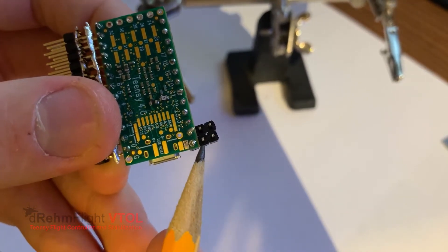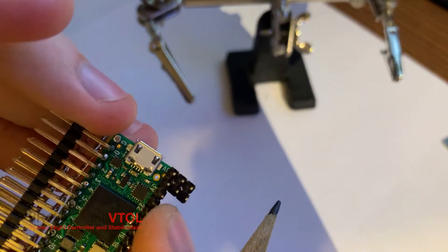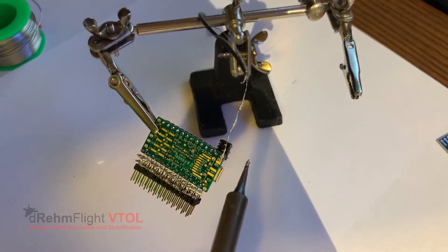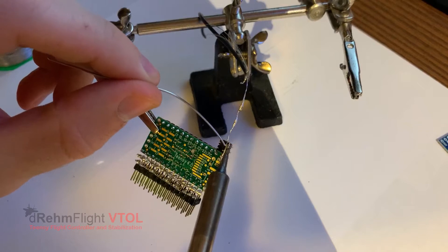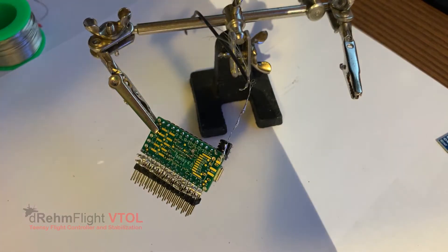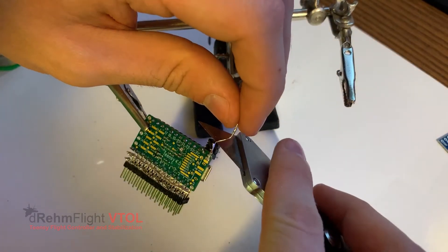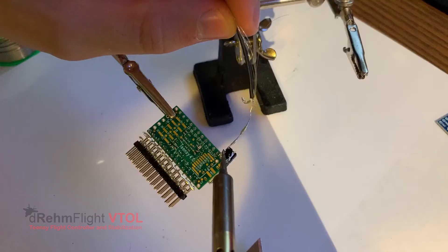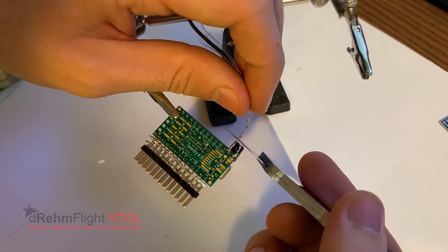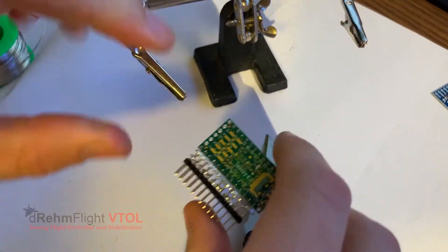We also have to do that for those three pins for the 5-volt and ground pins that we soldered to the other side. Following that exact same process, I'm going to solder those three pins together. What this is doing is just giving us access to plug in more devices that might need power — your receiver, your IMU need power, and you also need input power, so this allows you to just plug it directly into the Teensy. There are many different ways to do this soldering of the board — you could do it on a breadboard, solder it up on a proto board, or even design a PCB. This I just found was the simplest, and it works pretty well.